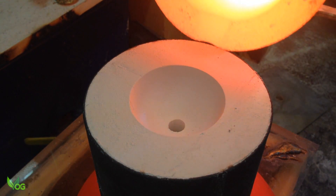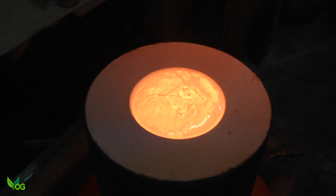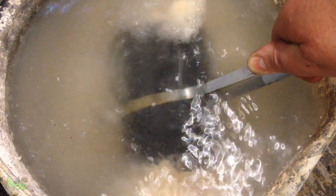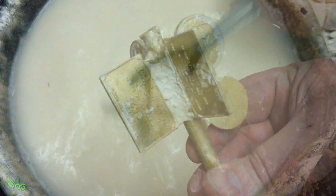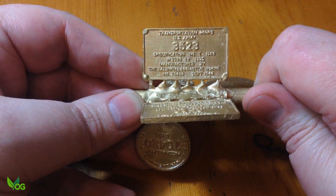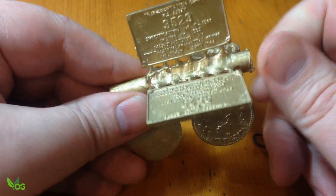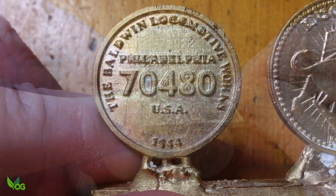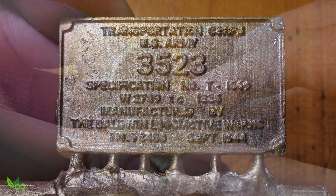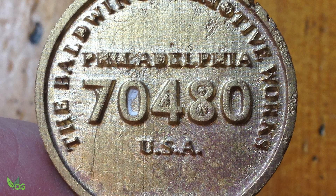Notice that the plaster is fine. Some folks told me the plaster breaks up with castable resins, but it hasn't happened to me yet — not with the PowerCast Burn at any rate. This pour looks smooth enough, though the casting gods were mucking me about just seconds before — I'd lost all electric power for a couple of minutes and everything cooled down a little too much for my liking, but things still seemed to go well. These castings don't look too bad; some of the letters are less than 2mm tall and they can still be easily read. But things weren't perfect — some edges were a little rough and some letters were partly filled with metal, so I had no choice but to try again.